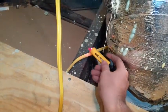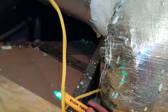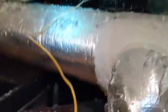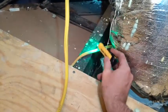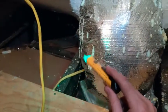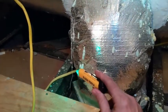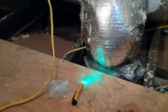If you put it up against a wire and it doesn't do anything, that means it's not hot. This is the wire coming out of the chimney, connected to nothing at both ends — you can see it's not live. This is the wire going into the wall and down into my bedroom for an outlet — you can see that it is live. Don't touch that. We're going to turn the power off, come back, check again, then cut it.